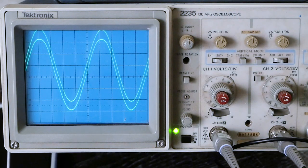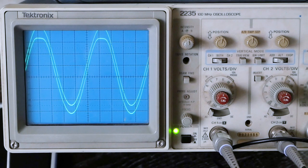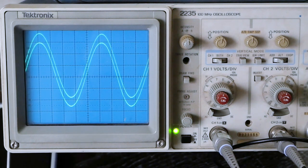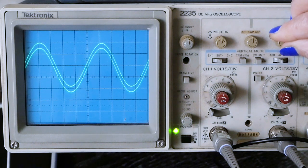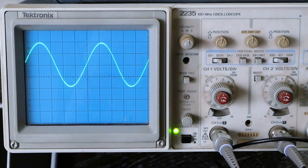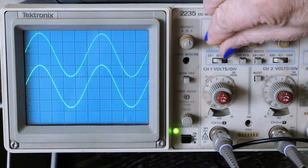A little over 6 volts peak to peak is where the clipping happens — the same as it was before. So we haven't changed where the amp clips, but it can handle 2 volts RMS without clipping. These signals just overlay right on top of each other — that's a nice, clean signal. So we didn't lose anything going to the larger cap, but we did gain the low-frequency response, and we should see that on the square wave. Let's switch this thing over to a square wave.